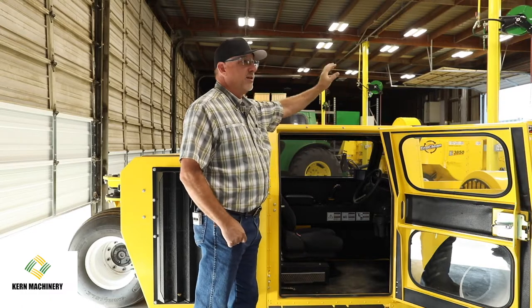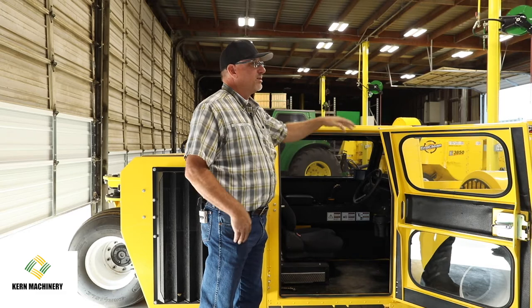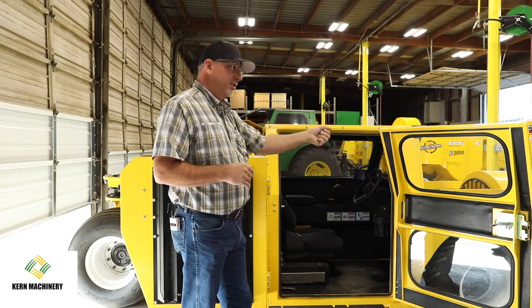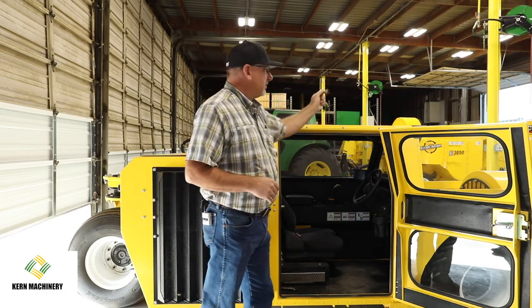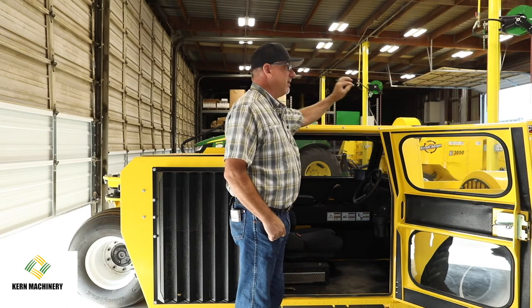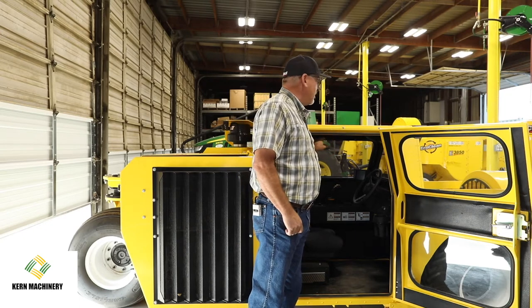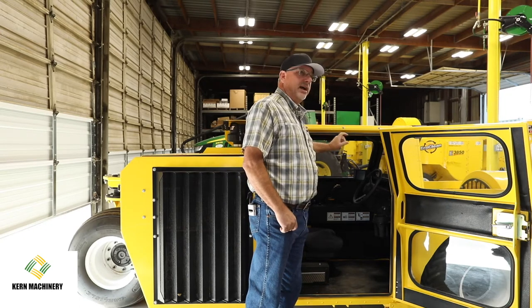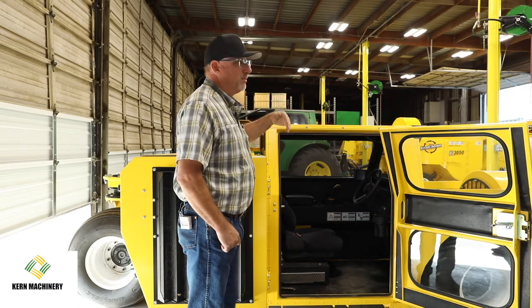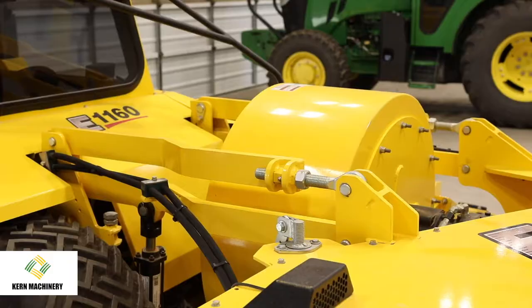And these blowers have a lot of force, okay? Cranked up wide open, sometimes you're going to be overblowing and you do need to dial it back. So we have a sensor on there that says what the RPM of that blower is, and it's on the computer screen, it reads it out. So wide open, that blower can run 3,200 RPM, okay?